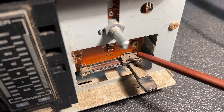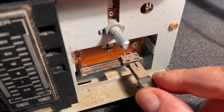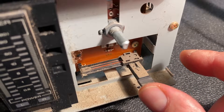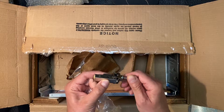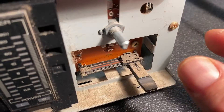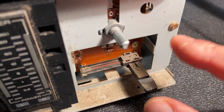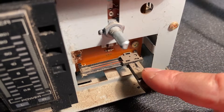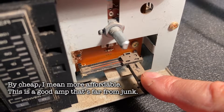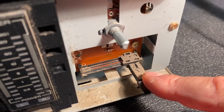It's no wonder we're having trouble with this control. When you slide it, it does somewhat clean the track, but this is a very poor design and a very low quality control. If you saw my Heathkit preamplifier series, you'll remember I talked about the high quality components Heathkit included, particularly the controls. When you see a control like this on another product, you really start to understand why some audio components cost so much more than others. Cheap audio gear is often made of cheap components.